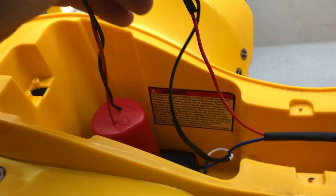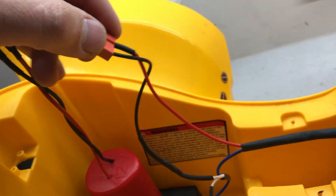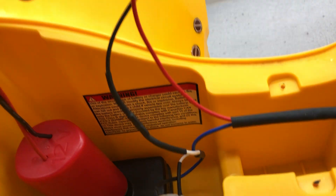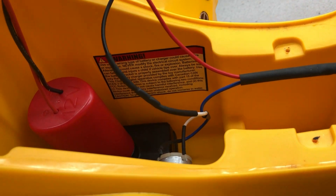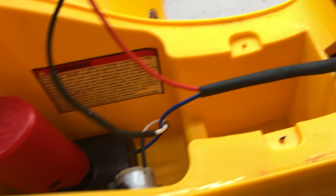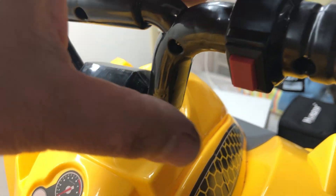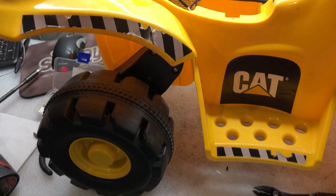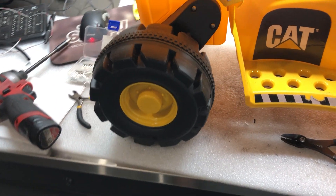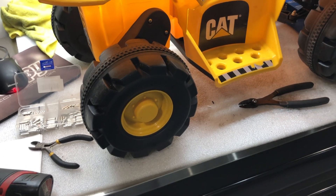It had this charging port like I said, and I figured out that the power just goes through the switch — that's about it. It changes colors a bunch of times but it's pretty easy: one's a direct ground and one just goes through a momentary button. So that is a significant improvement over what this originally had.